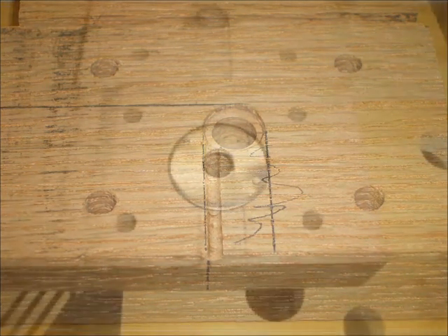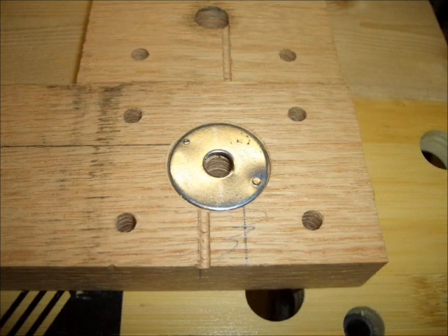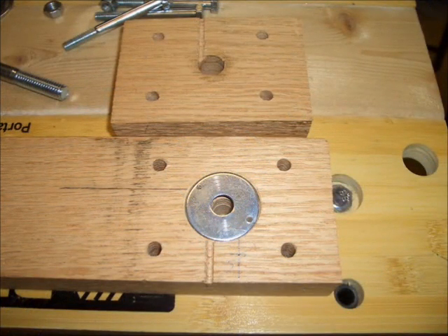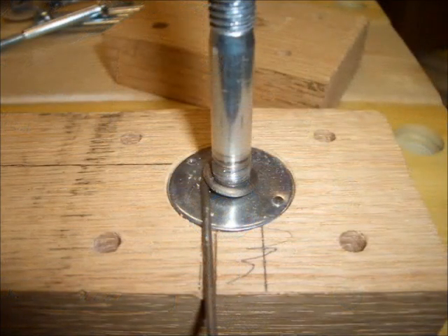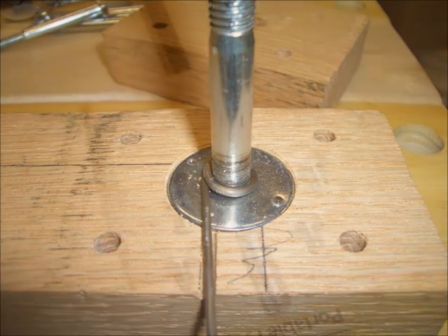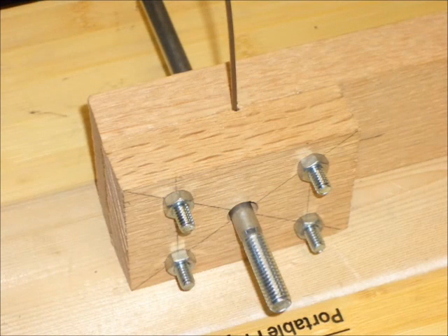There you can see the 1/8-inch diameter hole. I then countersunk and installed a steel fender washer in the back part of the jig. The purpose of this washer is to force the wire to come out the front of the jig as it coils around the steel rod. I tested the jig with a 7-inch long, 3/8-inch diameter bolt. You can see the bolt installed with the Kanthal wire started around it, and this is a view of the completed jig with the wire inserted.